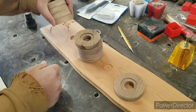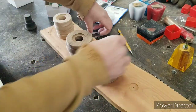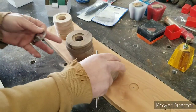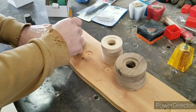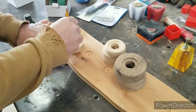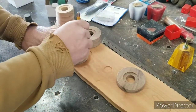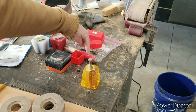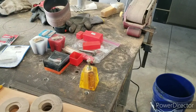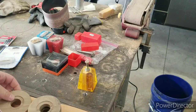So basically what I've got is these four good ones, these four here, and this one that came out kind of jacked up — I'll give that away for free. All I do now is take a pencil, these inserts sit inside here, and I just mark where the holes are going to go. All the holes are marked and I keep all this stuff together in a bag with these little pieces. I've got a 1/32 inch drill bit and I'll just drill every one of these things — not all the way through of course. I've got it marked with tape on there so I'll drill those next.